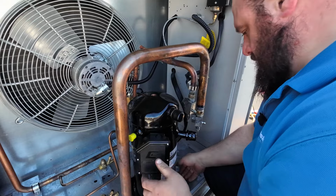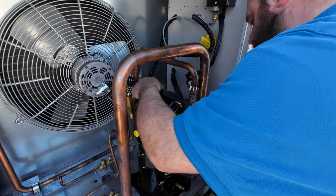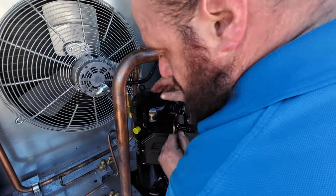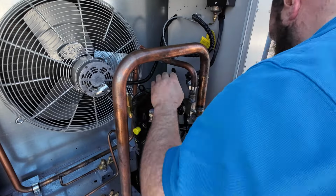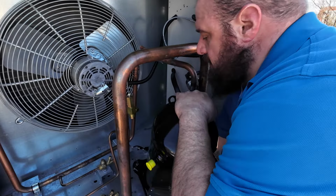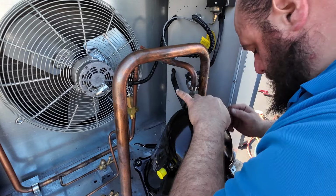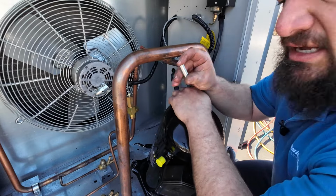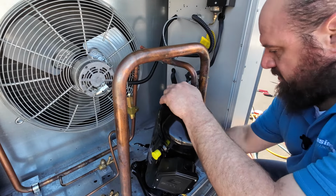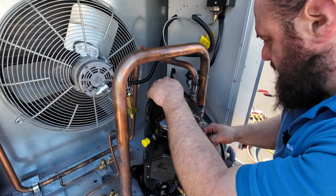Different front electrical plate there. Did I lose? Yeah, I did. I lost a spacer. I don't know where it went. Oh, still on the ground. So these have these little spacers that allow you to use a fully threaded bolt so you don't squish the rubbers down too much, because you actually want some flex in this to go.